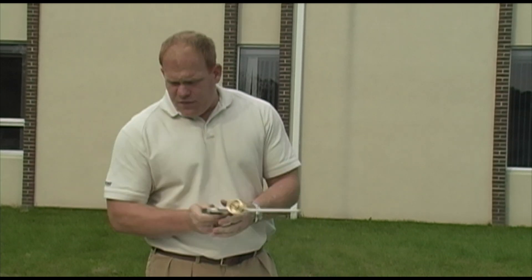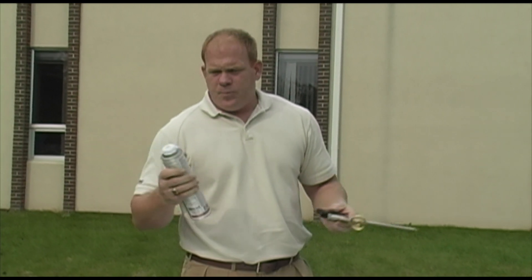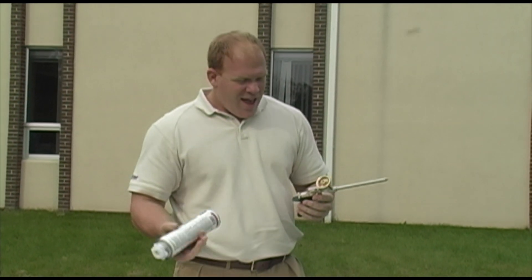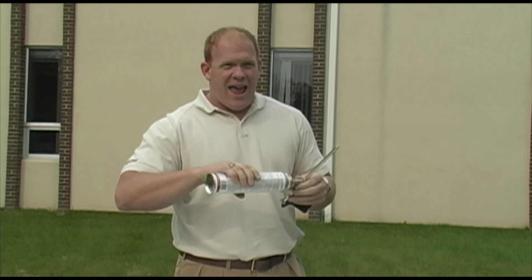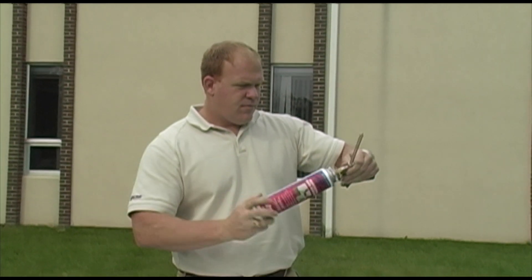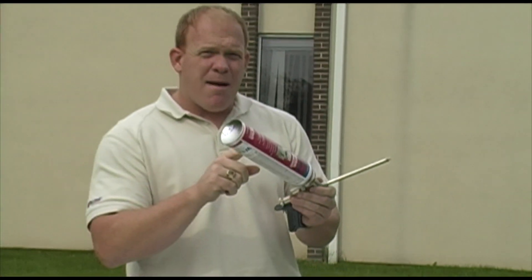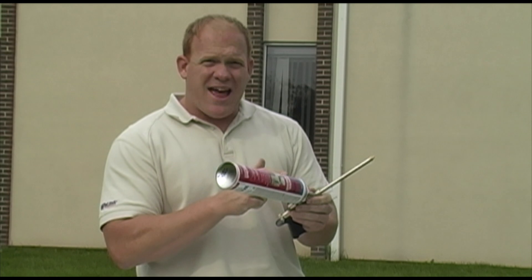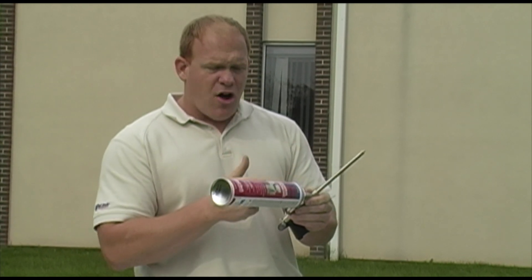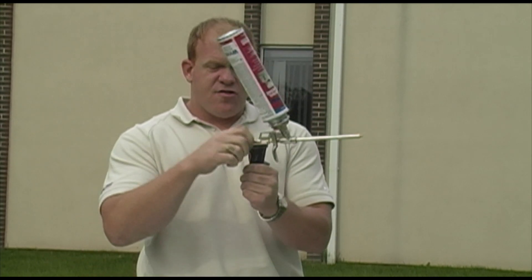You're good to go. This gun can be put on the shelf, and the can can also be put on the shelf and utilized 30, 60, or 90 days later. We do recommend that you always leave a can on the gun with the valve shut — even if the can is empty, it still seals off the basket area and the gun. Keep the gun like that in storage and store it upright so that the foam is at the bottom.